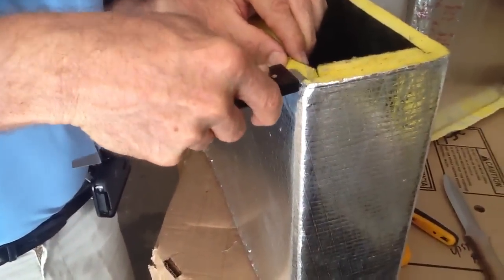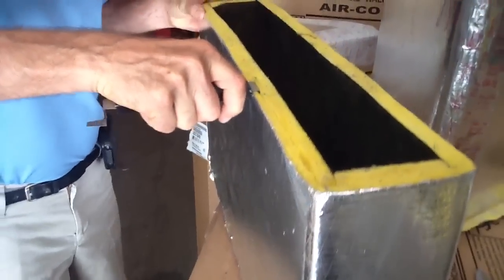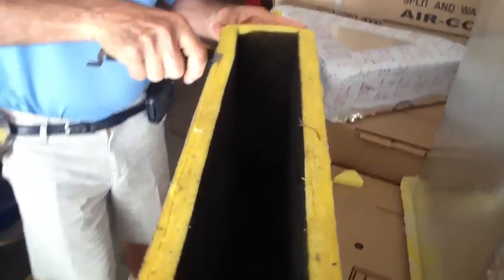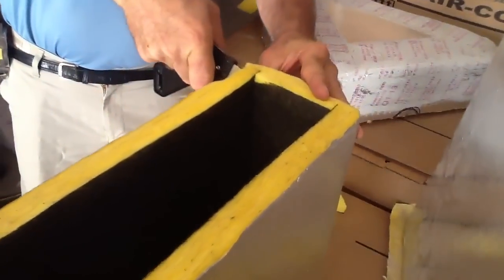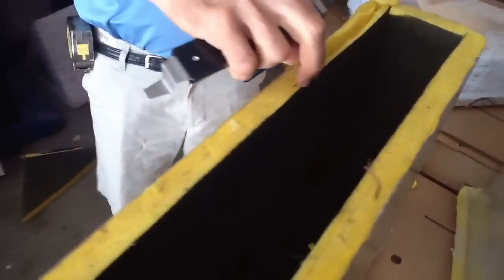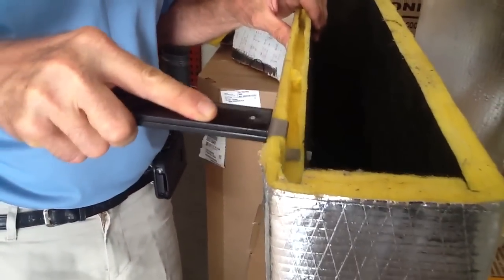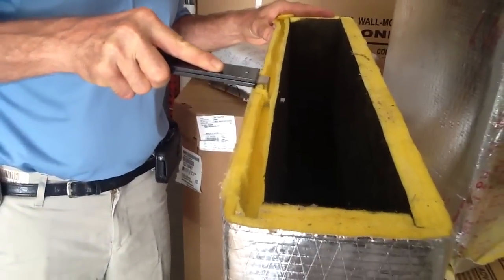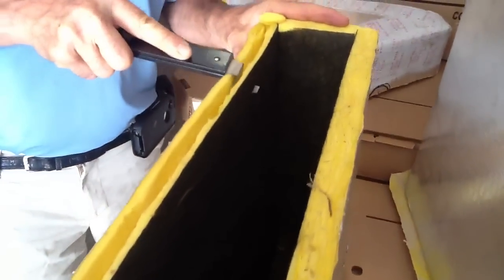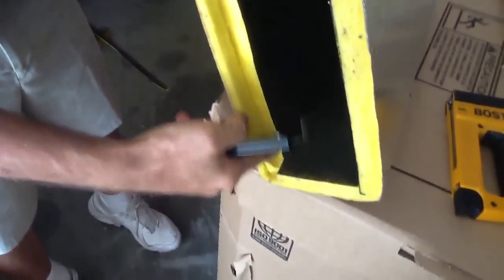Go in here, you're going to go down, you're going to bite it, and you're just going to run your tool very gently across the length of your ductwork. When you get to the end, you're just going to turn it up and come straight up, nice and straight. So now I have a groove in my ductwork right here — see, that's a nice neat groove.